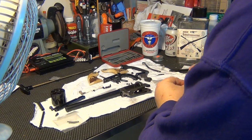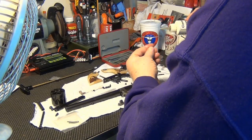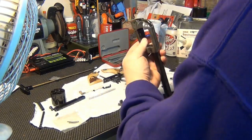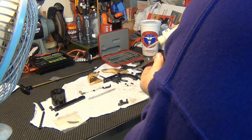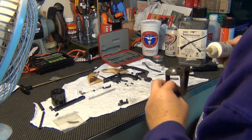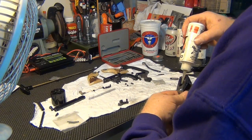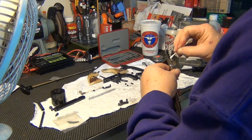We're going to get that lubricated up — put down a clean spot here, give her a screw and the pin, and especially the spring. Those should be ready to go back in. We're also going to put a drop over here in the loading gate and a drop in our screw holes, so we don't have to mess with it again as we put it back together. I'm going to go ahead and lubricate the inside of that also while I've got it.